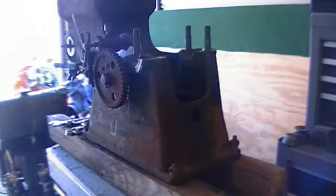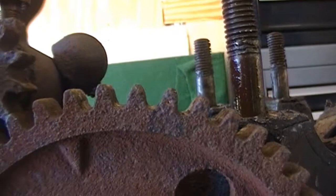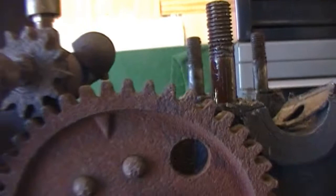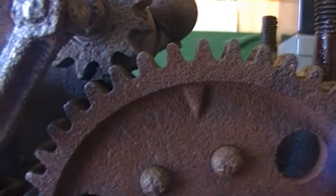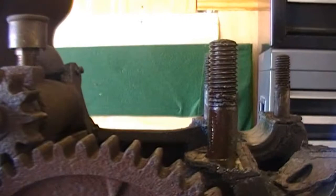Alright, I'll show you my timing marks. You can see one right there. I tried to color that with a Sharpie marker, but it didn't come out very well on the rust. Now you can see that originally there's a casting here, this little arrow, but I've never been able to find a distinguishing point on the crank gear that it locates to. So whenever I made those marks, this tooth just happened to be lining up with the tooth on the crank gear, so that's where I made them. And the crank gear marks, I can't find them, they're on there somewhere. Anyway,